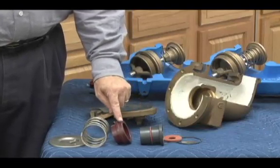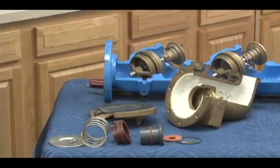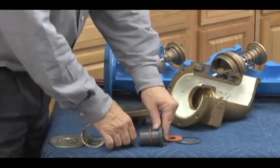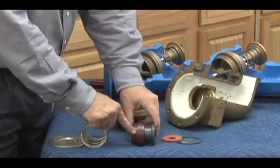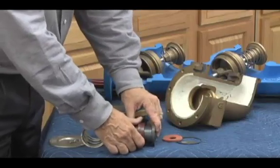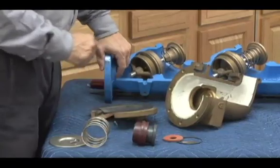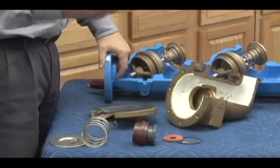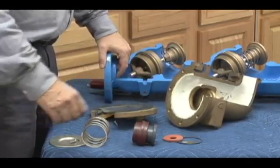Again, more dimensionally stable than any type of rubber or plastic material that may react to pressure, temperature, or other conditions. So the dimensional stability of this relief valve is increased dramatically by having the hardened guide, the hardened plastic, and going to the silicone rubber on the relief valve. Here's a case where if you had a softer plastic on the stationary spacer or a softer plastic on the guide, you could expect it to react, and that reaction being a swelling in most cases, where it could change the interface of the workings of that relief valve.